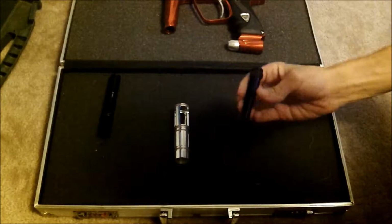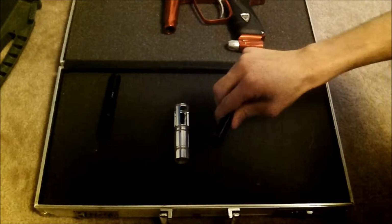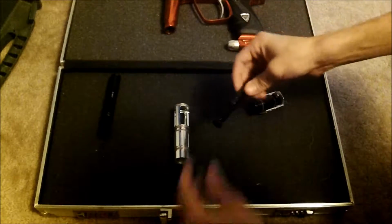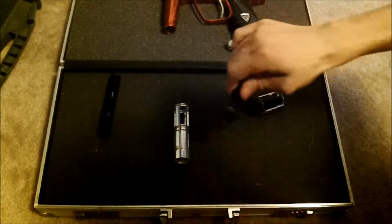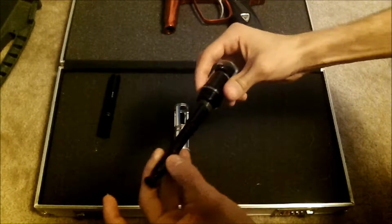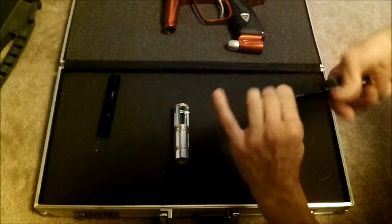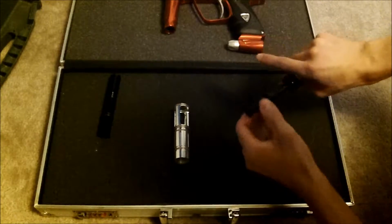And when you go to your rod, I got 4 O-rings on my rod, so I'm going to get a good amount of grease and just rub my finger around that. Good. I'm going to put a little bit of extra just on the back, because I want to try to get that O-ring just around the edge here on the inside and just kind of roll it in, and you can just screw it back on. Hand tight is good enough, you don't need to torque it down.